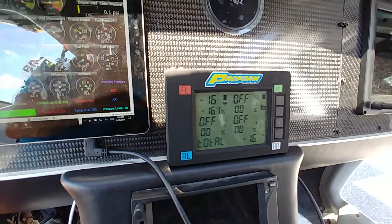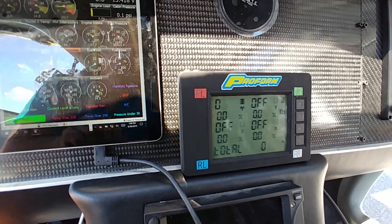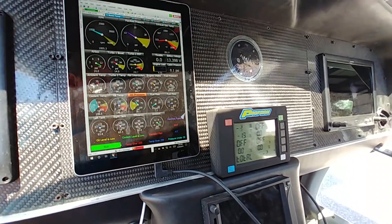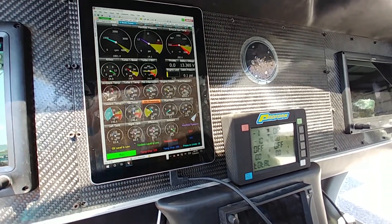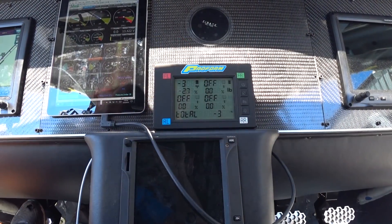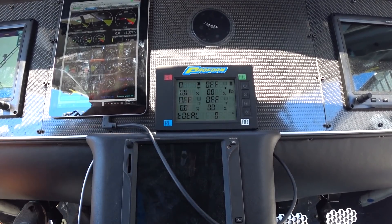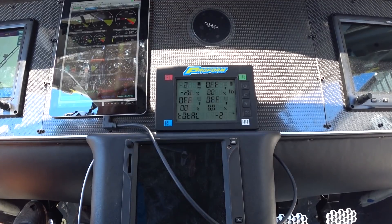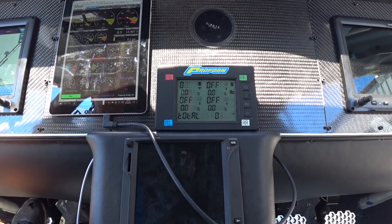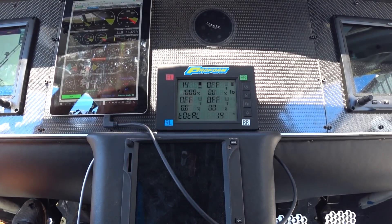Welcome back. At the end of last week's video I challenged you guys to figure out how much thrust or weight was going on the nose when I was doing a run-up with the scale. This is the video from back then - I had my scale in there, zeroed it out once I was sitting in there, engine running and idling at 1000 rpm. There were two runs: one not quite to full power, and the second one basically to full power with some prop pitch in there.